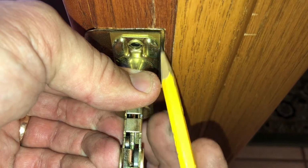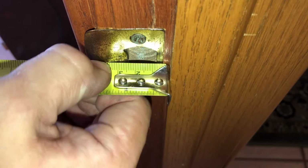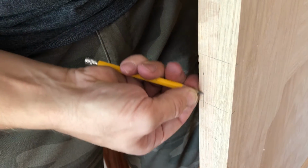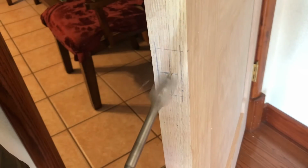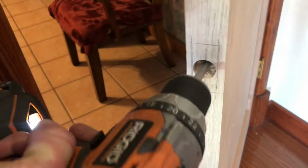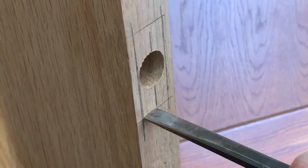The ultimate goal for this door is to fit here perfectly and look and feel like it has always been there. Installing the lock is a bit tricky. I mark where the lock stops when closed, measure and transfer it onto the door. A seven-eighths of an inch drill bit is used to make the cavity for the lock itself. Lock flange recessed area is chiseled out.